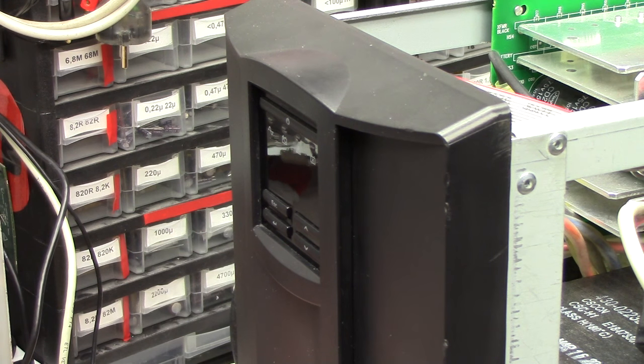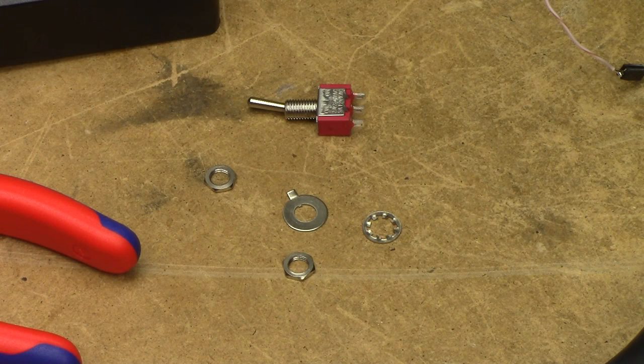However, I still want to be able to use the front panel, even though I may have to manually activate it in order to do so while using the smart protocol connected to my server. The solution to that problem is very simple: I'm just going to add a switch which will connect the receiver line of the main processor to either the internal comms processor or to the MAX232, which will enable me to quickly switch between manual front panel mode and remote mode being controlled by a computer.